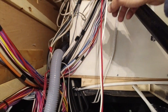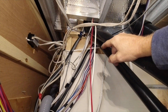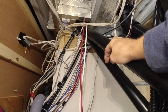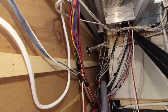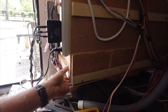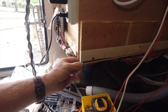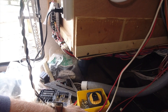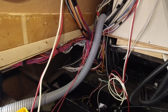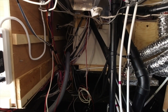Basically there's a chute that goes — this is the pre-wired solar — so I'm going to see if that chute goes all the way to the roof. If it does, I should be able to just drop the new solar lines straight down and use this as pull wire. I'll take their box off the roof and put my combiner box in place. I'll build this wall out about an inch and a half and then sheet it. I'll also put a brace under this — this is the outdoor kitchen in this model — just to the floor to make it more secure. The other side is already sitting on the floor. Other than that, I'm about ready to start mounting equipment very shortly. Let's get to it.